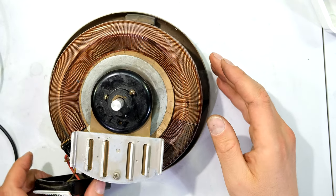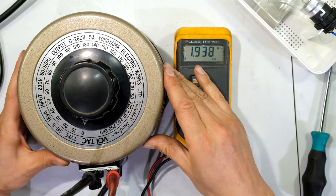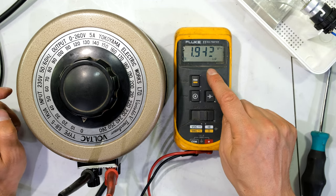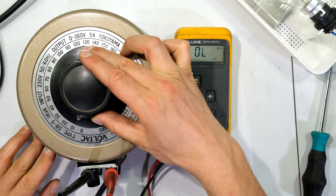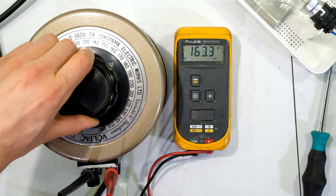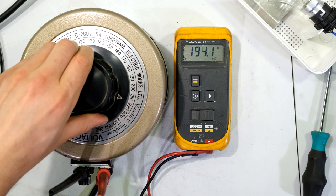I just wipe — you can see how it's cleaning the excess carbon that has built up over the years. This will make it have a more stable output. I'm going to close this and show you one last thing that people often don't realize. I've connected the supply to the mains; there is the output of the variac — it's very low, 1.9 volts. Notice that as I turn this the voltage is actually more stable now since I've cleaned it with that contact cleaner.